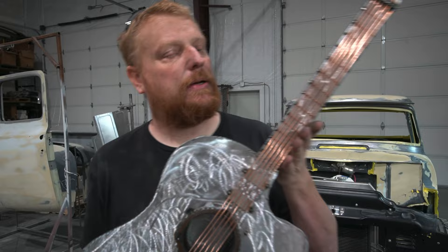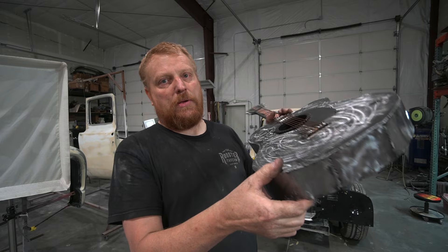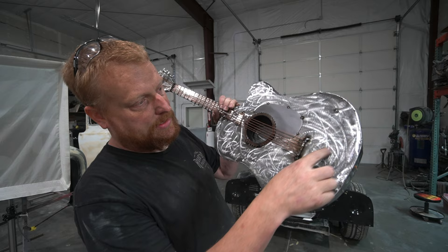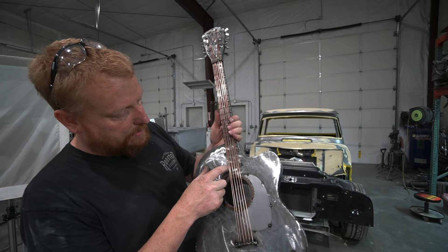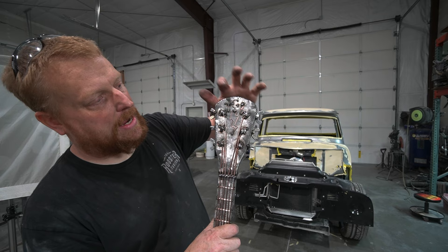And we're back. Finished up this little acoustic-style guitar. So this is just a piece of 20-gauge sheet metal cut out, a 3-inch wide strip here that we welded into the top of this. This was another piece of 20-gauge sheet metal that was just scotch-brited. This was actually ground with a 36-grit roll-lock disc. And then this was, I believe, out of a transmission or something — I don't even know where this came from right here — but I just thought it made kind of a cool hole for the acoustic-style guitar. These are some stainless steel strips.